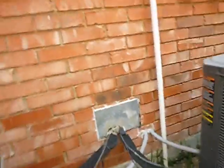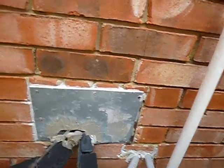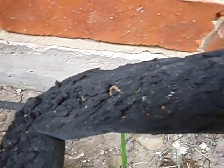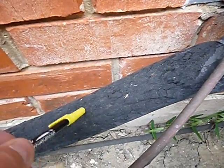Minimum fuse is 30 amps — breakers are 30. We'll check that at the electric service panel. This foam insulation was okay when the system was installed, but they don't use that anymore because it gets all cracked and compromised — squirrels can chew on it. By today's standards that should be rigid, not soft. These holes should be resealed. The refrigerant caps are also not anti-theft, which was fine when the system was built.